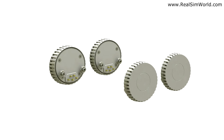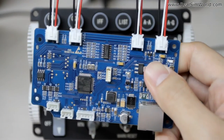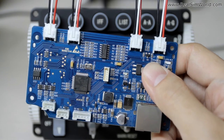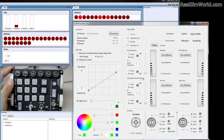I'm starting to sense a lot of curiosity on the thumb wheels. A thumb wheel is essentially a potentiometer coupled with a mechanical switch. At least that's what it used to be. Our controller board only requires the pot, and it's not meant to interface with the switch. It's designed this way because in Falcon BMS, both the HUD power on and off require a separate key assignment, which one single mechanical switch cannot provide anyway.